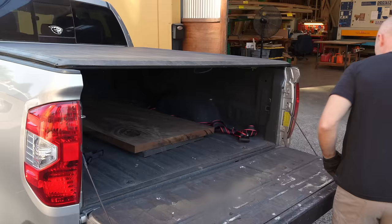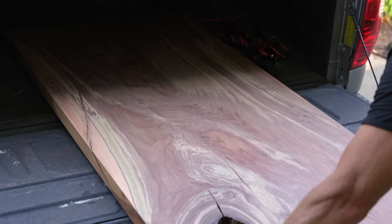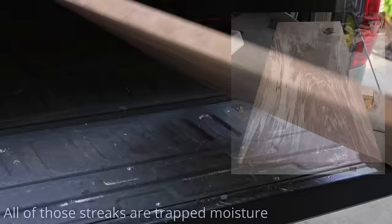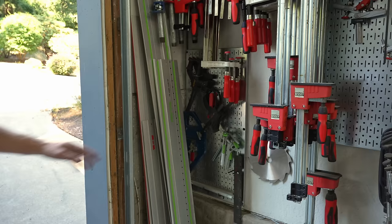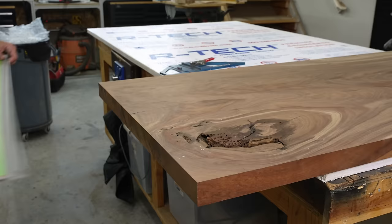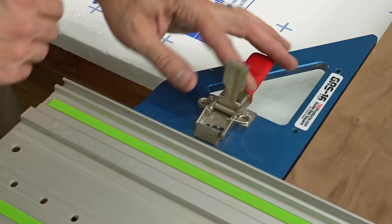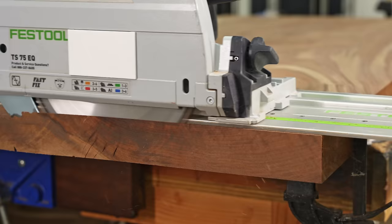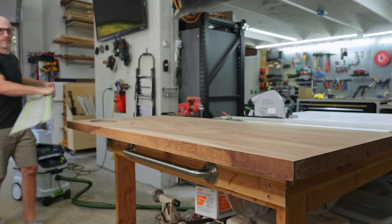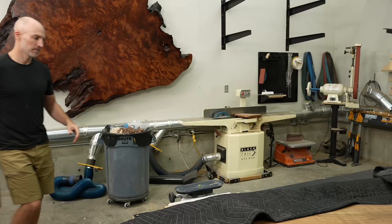I thought it was a great deal until I finally got around to using them a couple years in and found out he had dried these in the hot eastern Oregon sun — they had case hardened, trapping all the moisture inside. After three years in my shop they were completely unusable. I had to take them to Goby Walnut and they had to do several rounds through the kiln — surface it, kiln, surface it, kiln — just to finally get them dried. What turned out to be a great deal really wasn't, when you consider it took about six years before I could use them. Just something to be aware of when you're shopping wood: that initial great price doesn't always pan out.